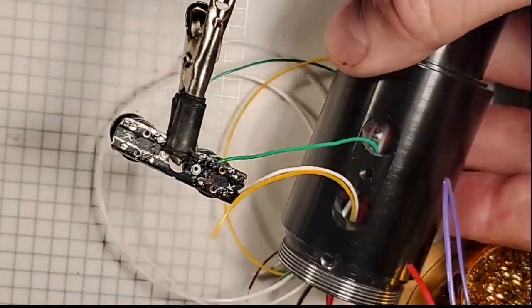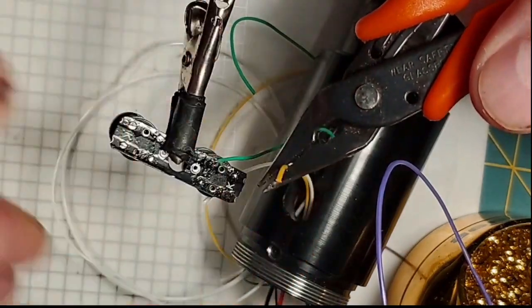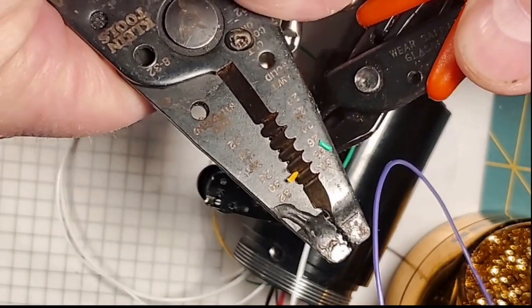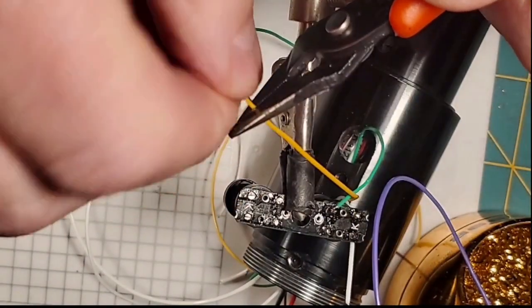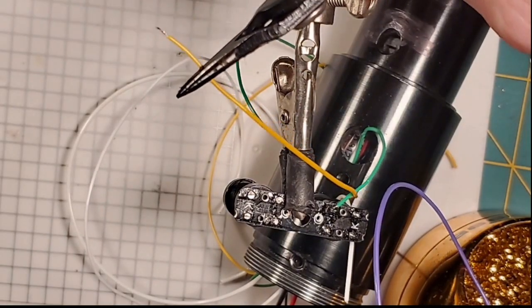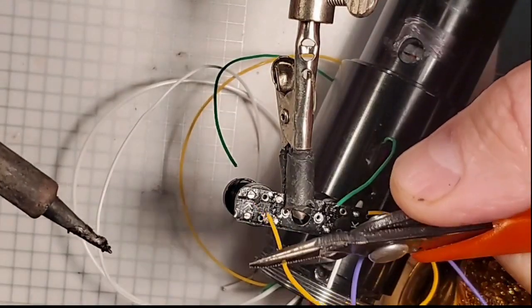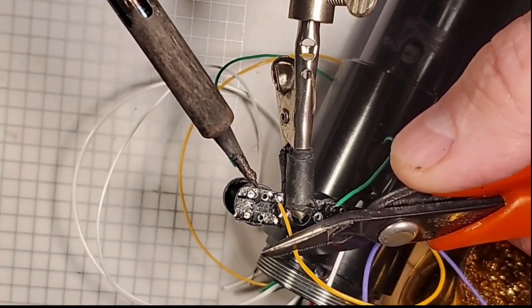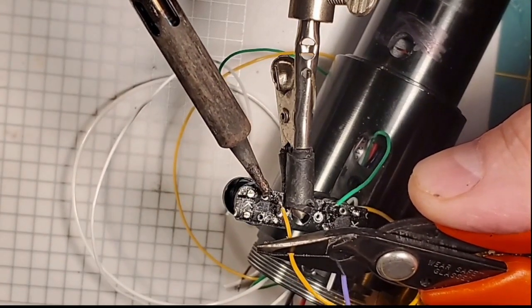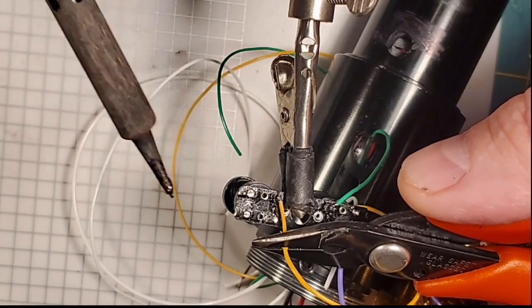And the wire is loose in there, so now I'm going to come over here and strip some of our auxiliary switch wire. Just a very ever slight amount of it. Twisting the strands together. Dipping in some flux. And we're going to go ahead and pre-tin our auxiliary switch wire. And I'm going to come in here with our auxiliary switch wire right on this pad on the side we've separated with the Dremel. This is kind of hard because I am working around the helping hands here and trying to keep y'all in frame. And that's good. I'll trim the excess wire there.